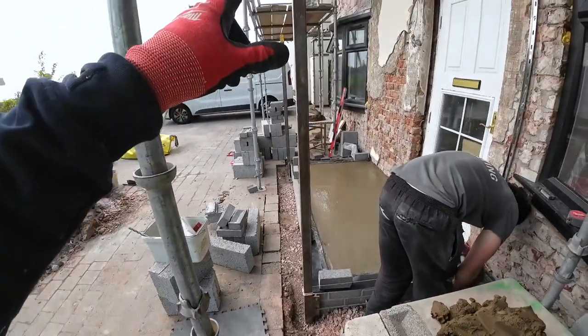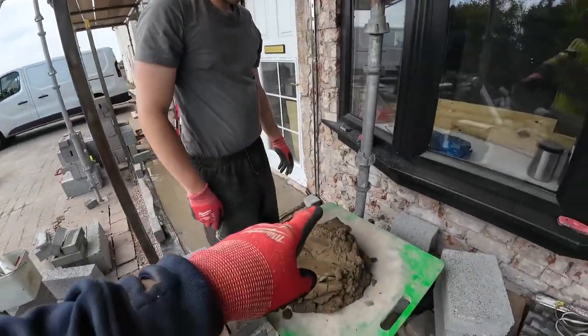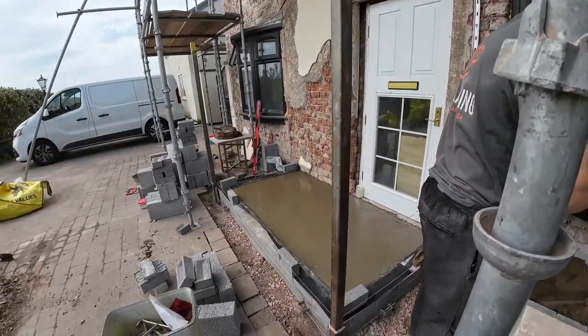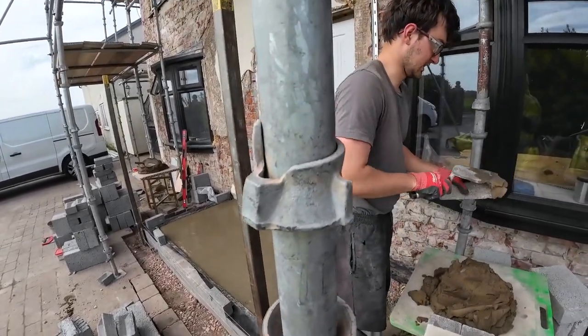So profiles are up, Blake's profiles. Always glad to get them up. Alex is putting his pin into the wall starters. I haven't got any wall starters because the render's still in my way, so I'm going to use bluebirds at my end every 6. Can't quite demolish that render yet because obviously we've just done a slab.